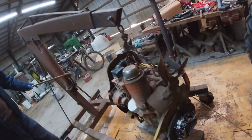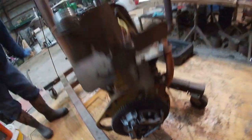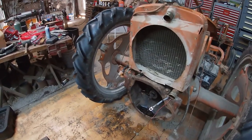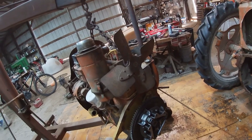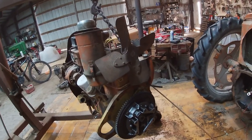To wind up pulling the motor off again, we've got to adjust these fingers out just a little bit. We didn't get them out quite far enough, and you can't mash the clutch far enough to take it completely out of gear, even though we measured like the manual said. So we're going to run those out probably a quarter of an inch and stick the motor back on.